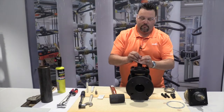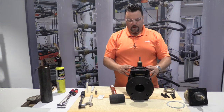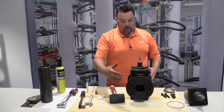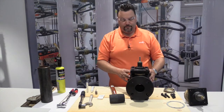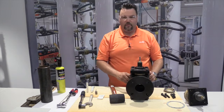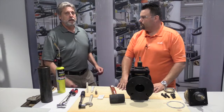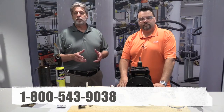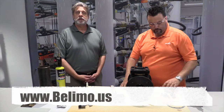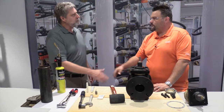As one last test, take your valve stem and slide it up and down, just making sure it feels smooth and free of any hang-ups. So now this valve has been rebuilt. One of our last steps is to reapply water pressure or steam pressure. As the valve is flowing, take note of any leaks. As your final step, reapply the actuator and linkage, power it up and hit adaption. Let it travel a few times, taking a quick visual look for leaks either from this section or from the packing. If you have any questions about anything you've seen today, please call Belimo Technical Support at 1-800-543-9038, or go to www.belimo.us and find this information under the globe valve section. Thanks for great training today.